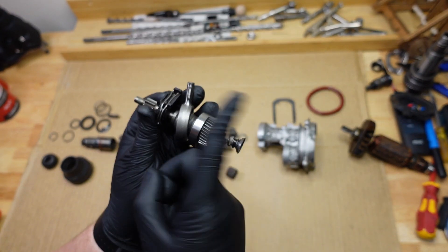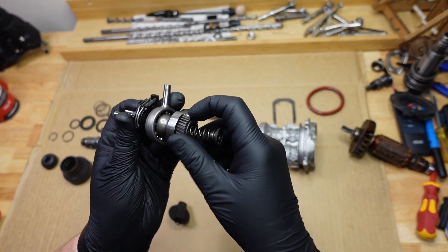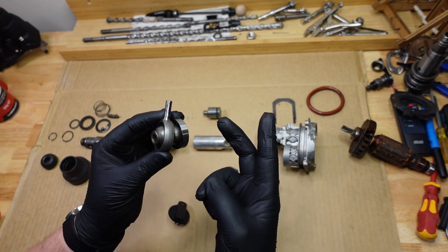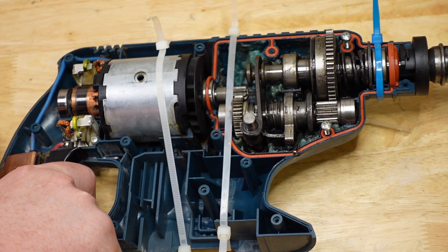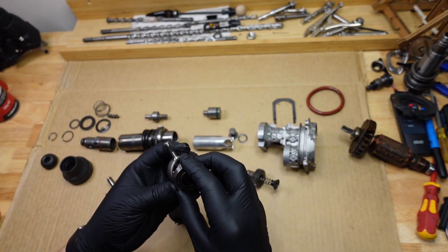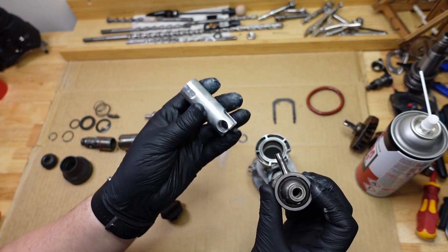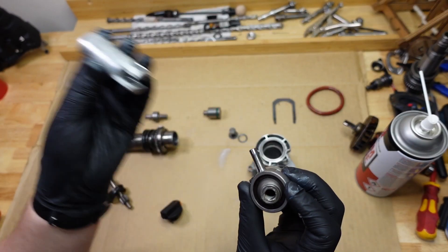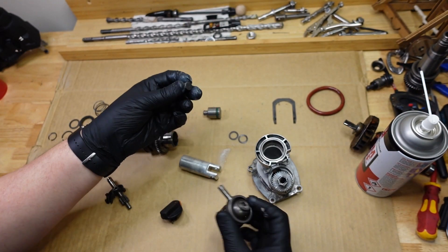This swing arm here just ends up going back and forth, and that is the source of the actual hammering. Different styles of rotary hammers have slightly different mechanisms — there is one that has a yoke, more of an A-frame piece that does that instead of just this swing arm. But this is probably the most common method because it's small, compact, and it does the job. The swing bearing is attached to this piston, which feels like aluminium, maybe for heat conduction or to reduce mass as it reciprocates — it has less inertia. The piston goes on there using these pins and a couple of washers.